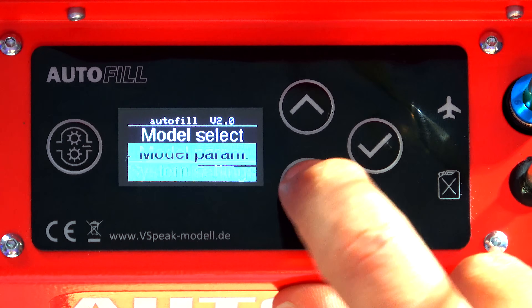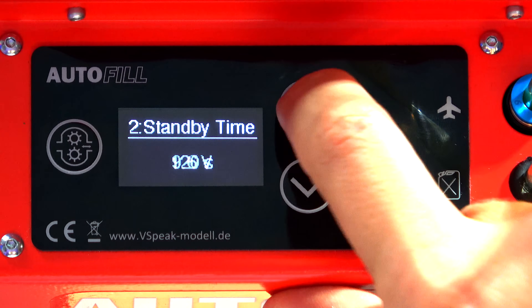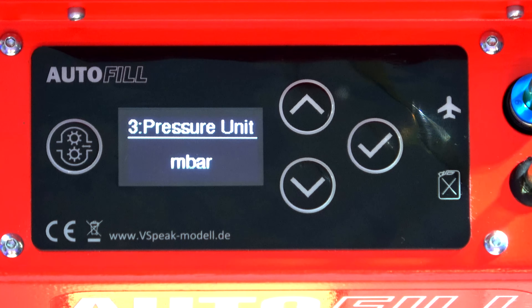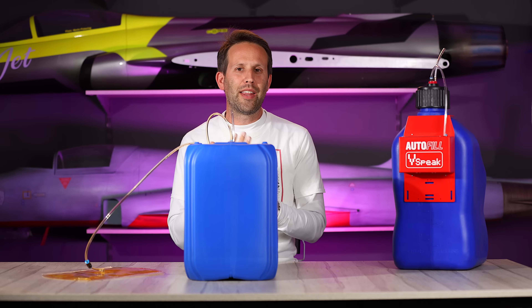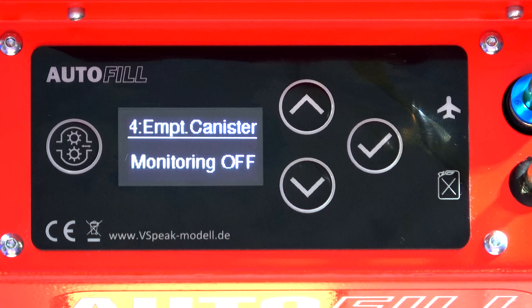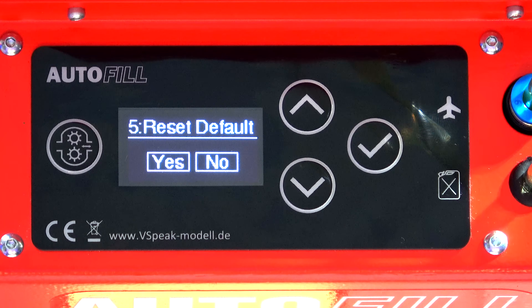If we've set it to fill two rigid fuel tanks, there are going to be a couple of extra duplicated menu items — one for the first tank and one for the second tank, working in exactly the same way. So we now have fill power two and delta pressure two, both applying to the second fuel tank. Finally, in system settings, we have a low battery voltage cutoff, how long before it goes back into sleep mode, what pressure units we want to read out — be that millibars or PSI. An empty canister option is available, however it comes set to default off, basically because if you have contaminants in your fuel it can give you an erroneous reading. And if you really make a mess of it, you have a reset option which will reset all the parameters in the autofill.